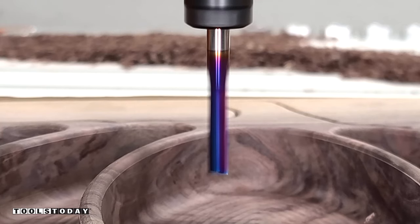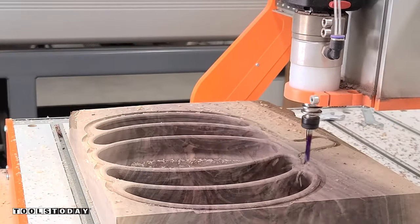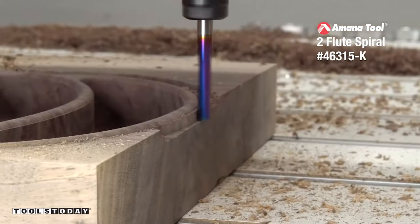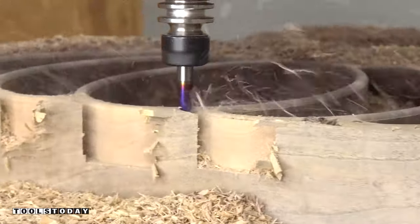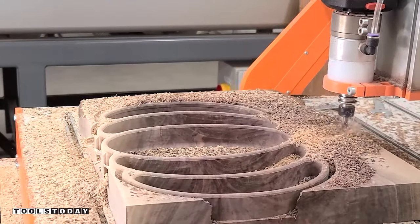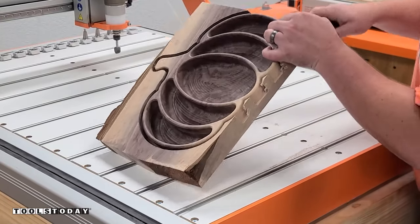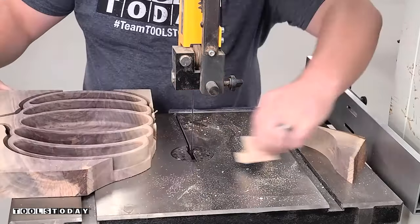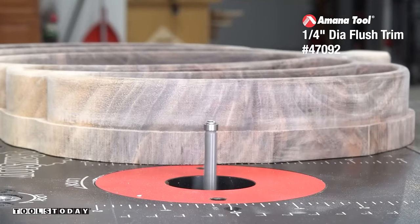We got the bit dropped off and picked up the 46315-K quarter-inch diameter upcut bit. We're just going to go through on the profile and cut everything out. This bit is not large enough to cut through the inch-and-a-half thick material, but we're going to go down one inch, which is the cut height of the bit. You really don't want to go any lower than the cut height of the bit as it can cause burning issues when the flutes are not touching the wood. After vacuuming it off, we can get it pulled off the CNC and taken over to the band saw to get the rest trimmed off — just going around the outside profile and cutting off the excess material.